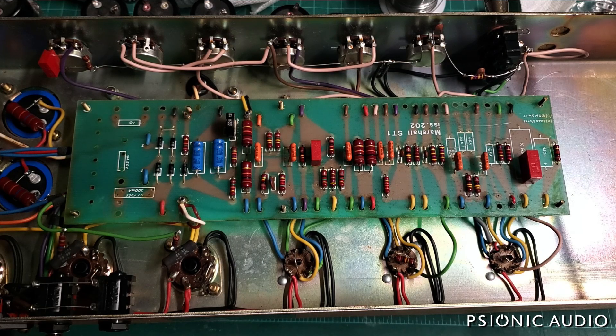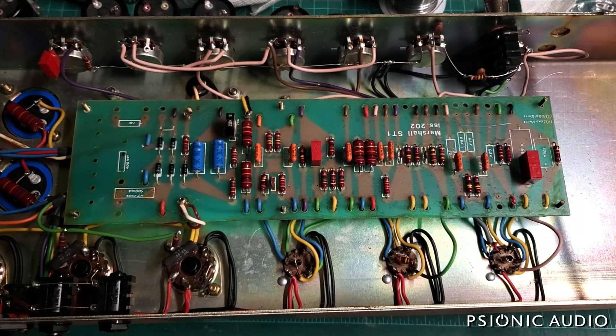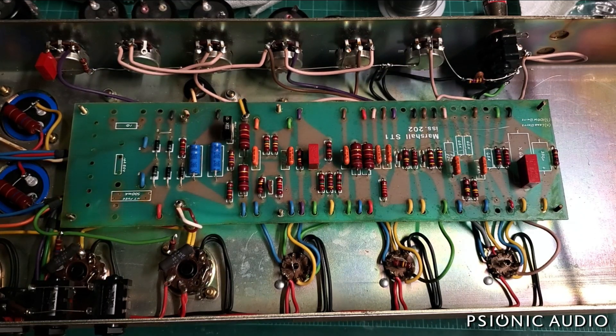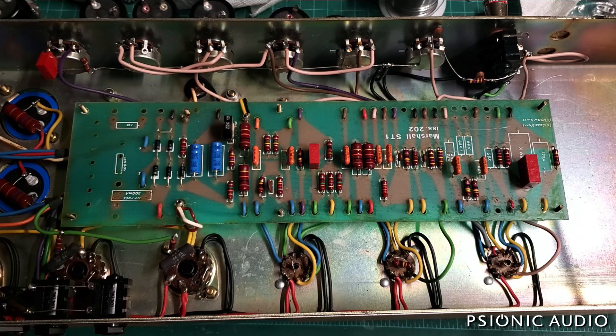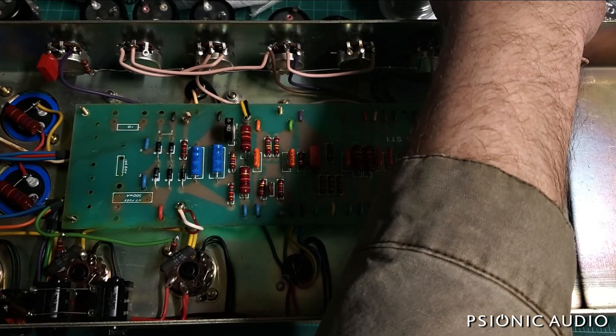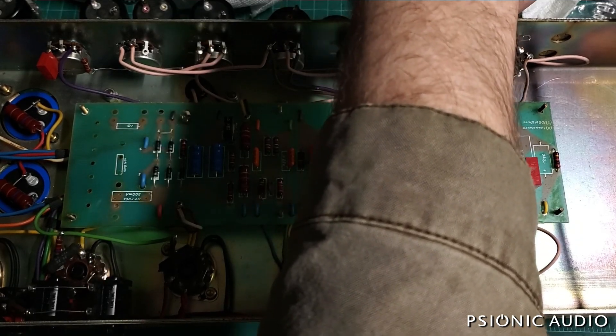I'd really like to get that down to like negative 33 at its maximum setting, depending on how you think about it. As a result, these EL34s are biased at about 18.5% each idle, which is very cold. And by cold, I mean that is Dual Rectifier cold. No one who likes tone likes that cold. Let's see how the high gain stuff is sounding.